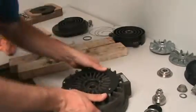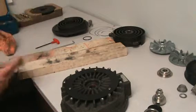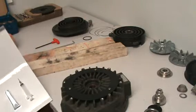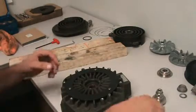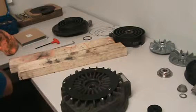Next step is to re-grease your seals, which comes in this kit here. This is also part of the major kit. The major kit will give you everything you need. So that is the grease? That's the grease. Awesome. Thank you very much, Tim. And this is specialized grease. This is not just any vacuum pump grease. There's a ton of different kinds. We had them tested over 3 or 4 years. This was determined to be the best. This is not just generic grease. Let me get my fixtures back before I lose them.